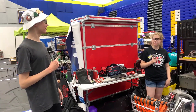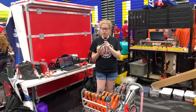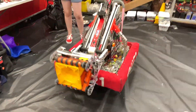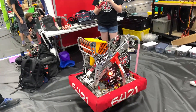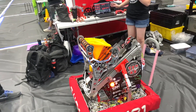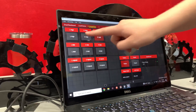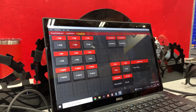Now we're going over to Kirsten to talk about their control system. Our robot is controlled by an enum that includes every single robot state that we have. For example, we have a state for when we bring the intake down to intake pieces, a state for bringing it back to the drive position, and then a state for scoring on hybrid, mid, or high nodes, and also for picking up from the substation. Those scoring methods are controlled by a touchscreen and our shuffleboard buttons. The left or right controls cone scoring, and the center controls cube scoring, because we have a lower speed set on our intake to reverse for those cubes so they don't bounce off the cube nodes.